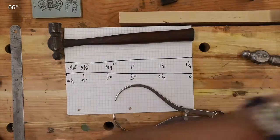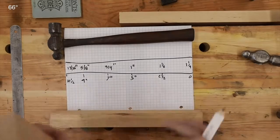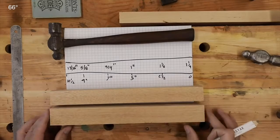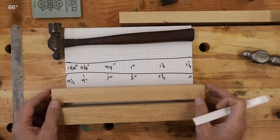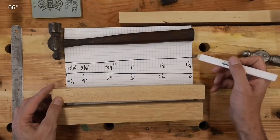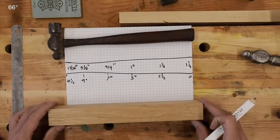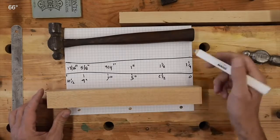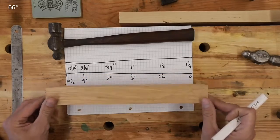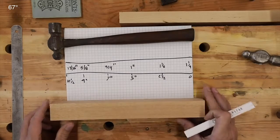What I'm hoping to do is put this on the lathe, set these caliper deals to the thickness we want, and measure these out as we go along. This is the billet we're going to use. The widest portion of this handle is an inch and a quarter, so I've ripped a billet of hickory at an inch and a quarter and then a second one at an inch and a half. If we do inch and a quarter, there won't be room to remove tool marks and sand it — it'll end up too small. We'll go over a quarter and start with an inch and a half, giving us an eighth each side. This beautiful clear American hickory with a nice grain will be a perfect billet.